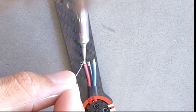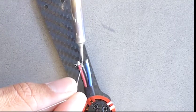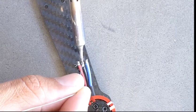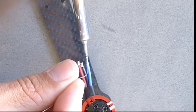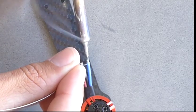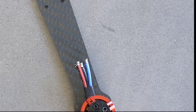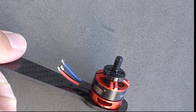What you want to do is bring your soldering iron under the wire and press the solder onto the top of the wire, slowly moving the solder back and forth between the soldering iron and the wire. If you keep these three points close together, you'll be able to get good connections. Also make sure that when you tin the wires there's plenty of solder on the end — make sure it's completely wet. You can tell the wire is done when it's nice and shiny and there are no bare parts of the wire showing, because they've all been taken up by the solder.